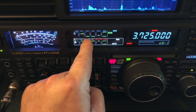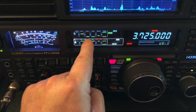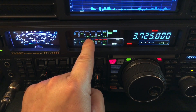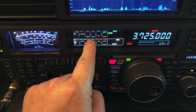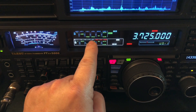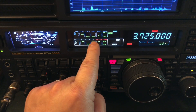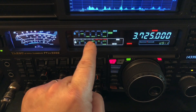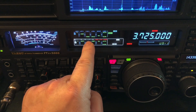I'm going through that circuit but not using it right now. The FTDX5000 has a circuit called VRF, which is a variable pre-selector. As I've mentioned before in the context of this radio, the FTDX101, and the ICOM 7610 — it's a variable bandpass filter that's even tighter than the width of the band. You can move it up and down inside the band for better selectivity. This radio also has the option for an external pre-selector called a mu tuner, which is even tighter than the built-in one.